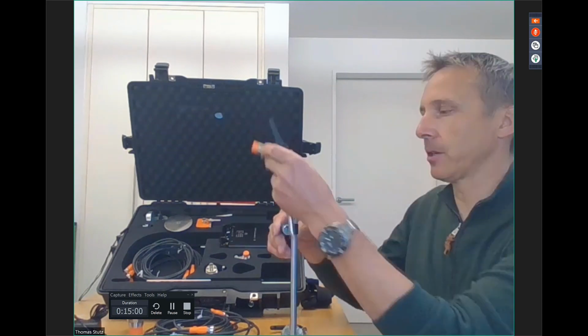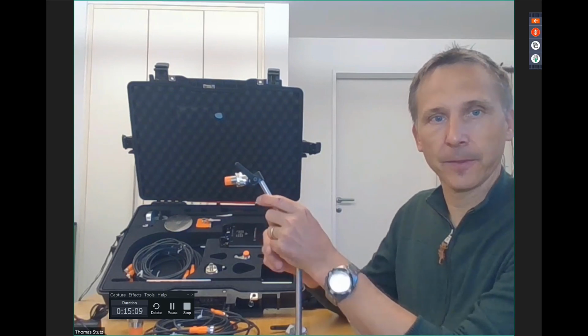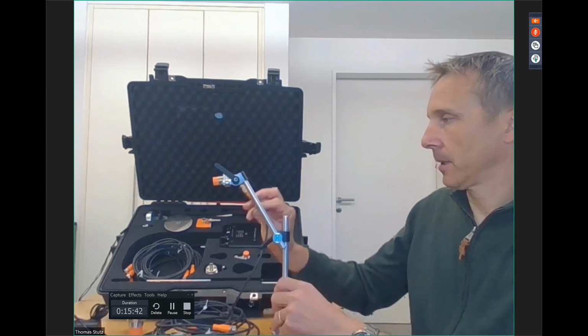So be careful when you measure on a gear in operation, that nothing falls into the gear. Please make sure that you only measure in a safe place where nothing can get trapped in the gears. You need to watch for safe access. In some kilns they need to make a safe opening or a safe door on the girth gear housing during a stop when the equipment is down. Then this can be installed, and later we can also measure during operation in a safe way. So that's the magnet and the cable.